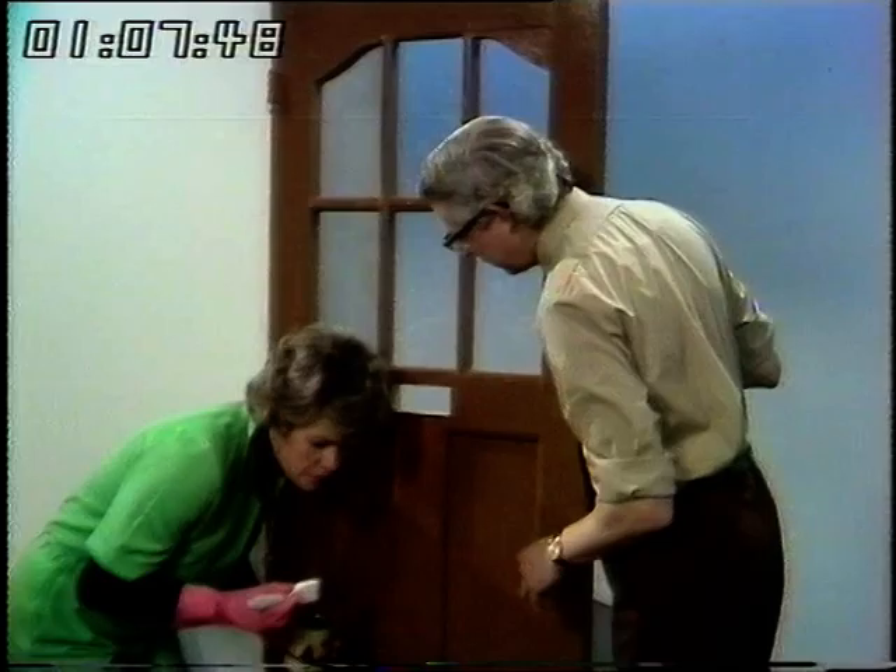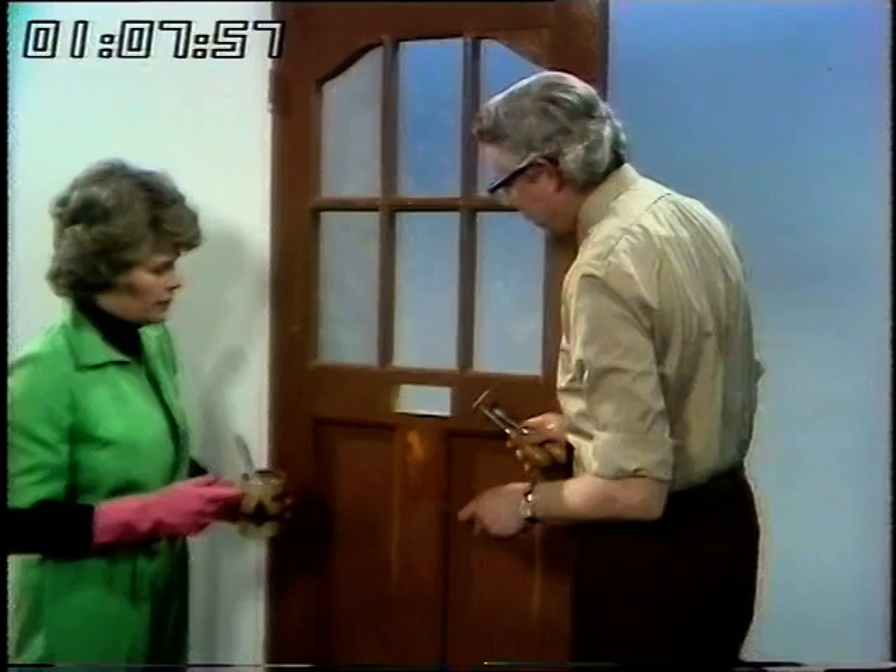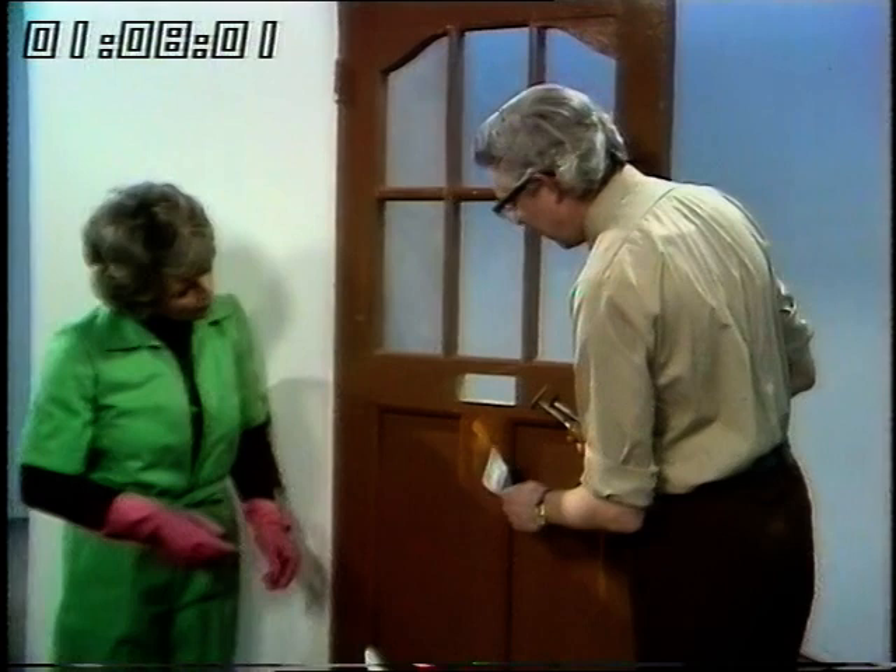Now what you must do is be very patient. If there are three or four coats on here you may have to give two or three applications before you really get down to getting it off. Look — you can see there, it's starting to come up. Having done that and got it nice and soft — normally you would wait about 10 minutes for this to happen — you'll see it start to bubble up, and then you would use a scraper on a flat surface.